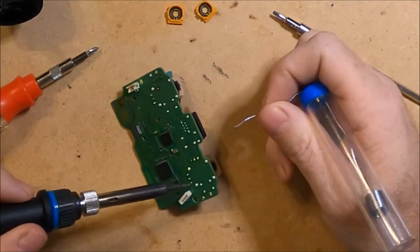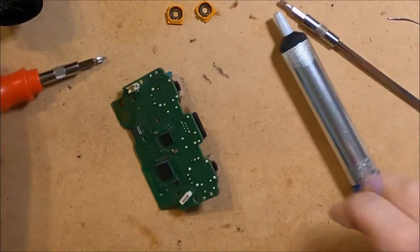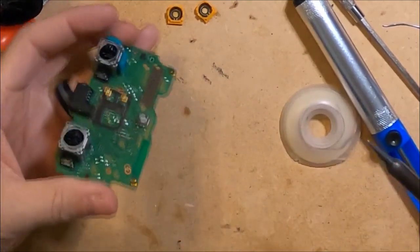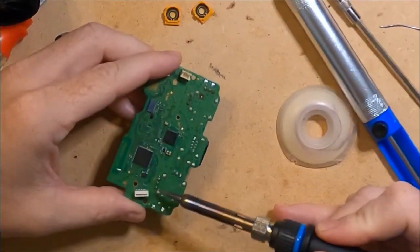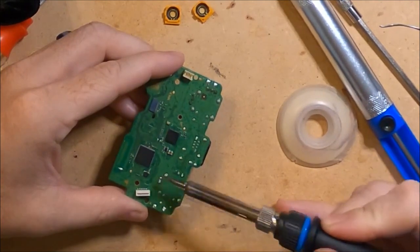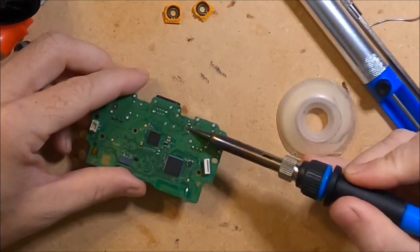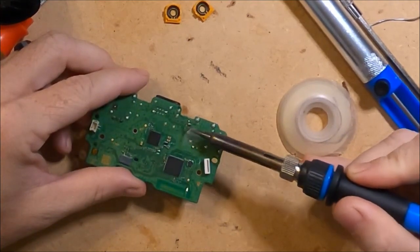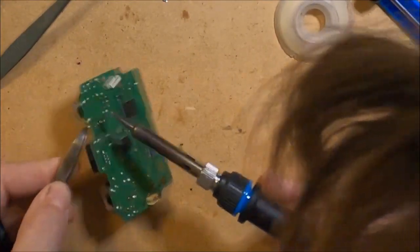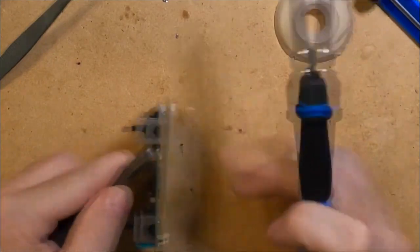I also added a little bit of flux. With the fresh solder added I will now take the soldering iron and apply a little force to the pin and push it down through the board. I do this for all six pins. I don't have to worry if my hands shake a little bit because there are no other components close by that I could accidentally damage. Now take a small pair of pliers or tweezers and hold onto the pin from the top side of the board while applying heat to the bottom of the board, and the pin falls right out.